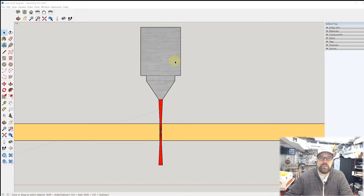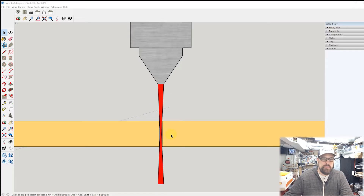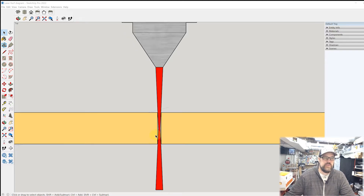I've drawn up a basic diagram to talk through this. This is typical of either a CO2 nozzle or the module for your diode laser — it has your laser beam coming out through a focus lens, possibly out of an air assist cone. Your beam is not a straight line; it's more of an hourglass shape. It comes into a focal point and then diverges back out, so there will be slight inconsistencies. We're looking for the average cut width.